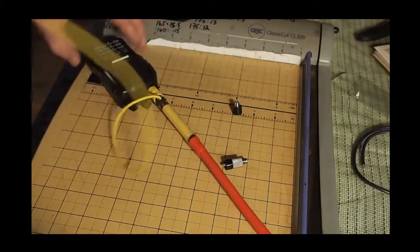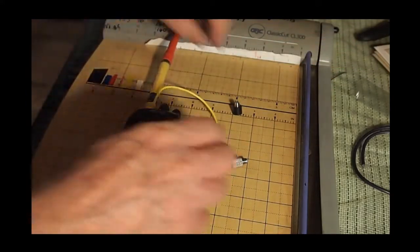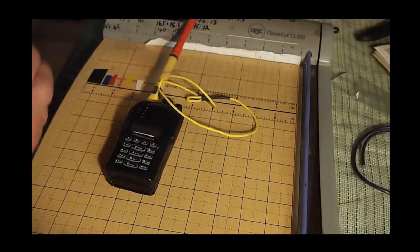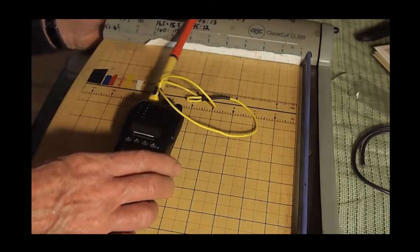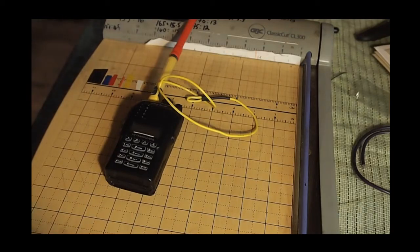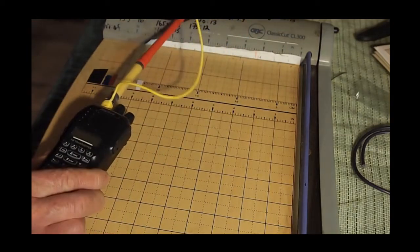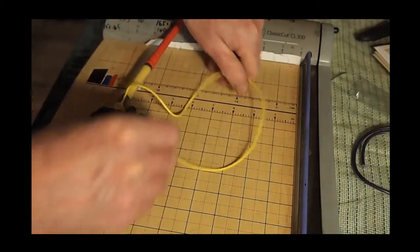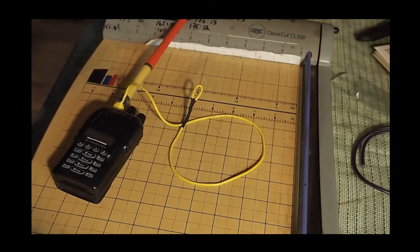We won't discuss the merits of how effective they are or how well they work. That's a different discussion. They are widely accepted to be an effective adjunct, but they are necessary when you don't have a good ground plane otherwise. If you are in a circumstance where you have a good ground plane established, then they're not really going to make much difference. So again, porous ground, or for example, snowpack, that's another good example of where this really comes in handy.